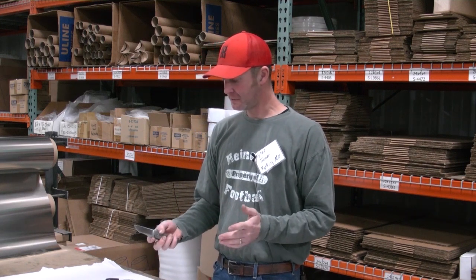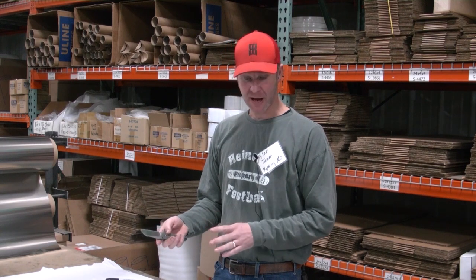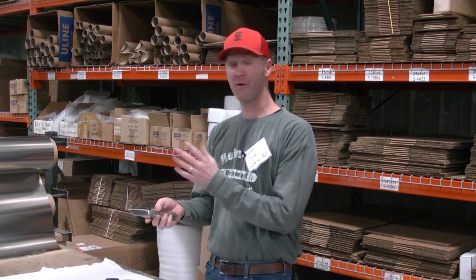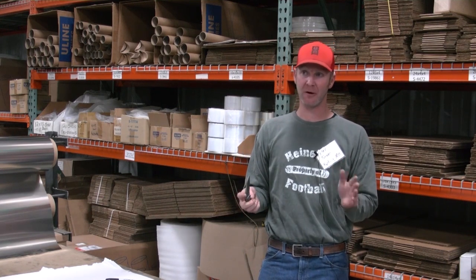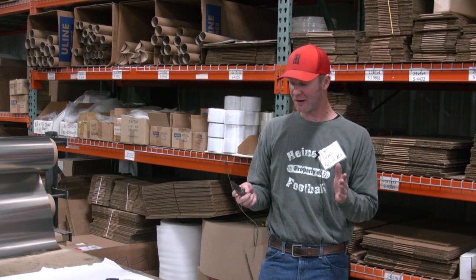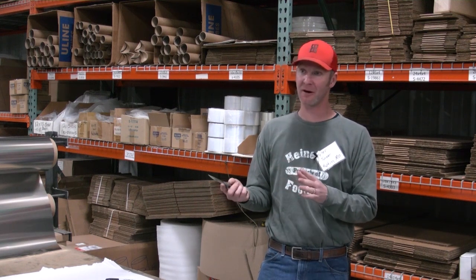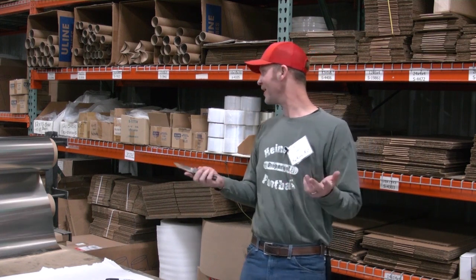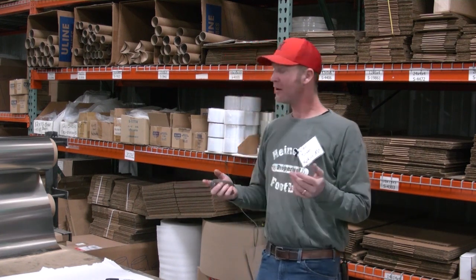Then after that, I try to set my locks, my engagement, at around 25 to 30% of the bar coming over, engaging the blade. 25 to 30% is kind of where I like to set them. That's not extremely early lockup to where people get nervous. It's not catching too much, but it's not at that 50% stage where I don't, you know, it's just, it's a mind thing, isn't it, Tracy, you know?